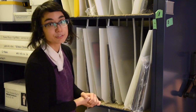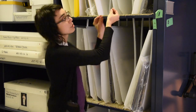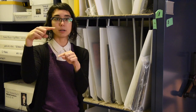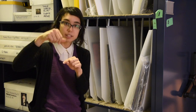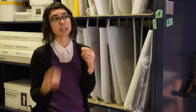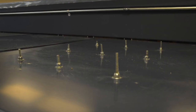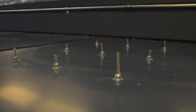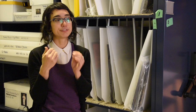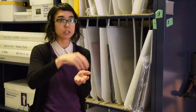The other trouble that we ran into was that when we got to the top, after all the shelves were in, the ready rod stuck out about 6 inches. Putting the nut on and trying to thread it all the way down would have taken way too long and was getting way too finicky. So we cut it with the hacksaw, but then the threads were gummed up a bit from the hacksaw, so we had to run out and buy a file to bring it back down to the manufactured threads, and then we could get the nut on.